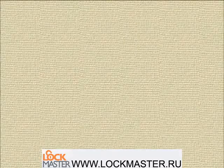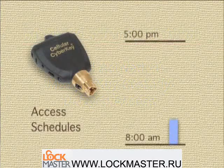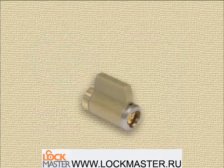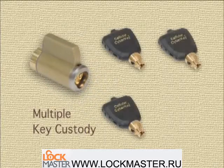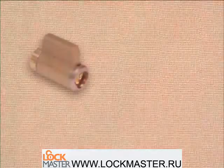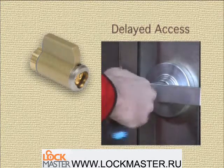There are three additional features that provide an even higher level of security. CyberKeys, unlike mechanical keys, can be set to expire regularly, even on a daily basis. CyberLocks can be programmed for either multiple key custody or delayed access. Multiple key custody is used when you would like two, three, or four keys presented to a lock before access is granted. Delayed access is used in applications that require a delay of a few seconds or up to 20 minutes between the time the key is first presented and the lock is able to be opened.